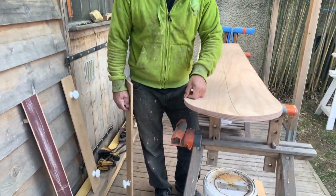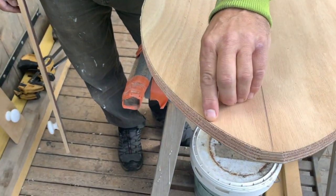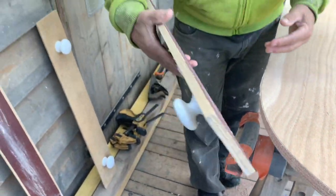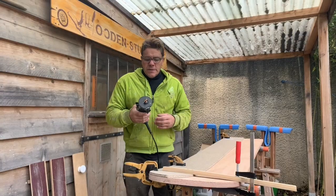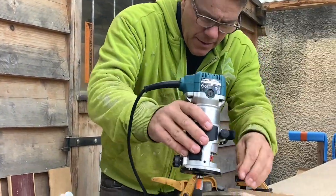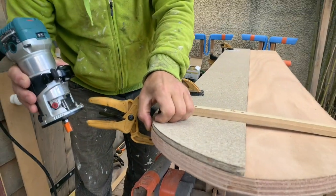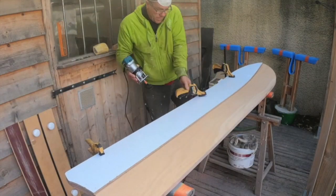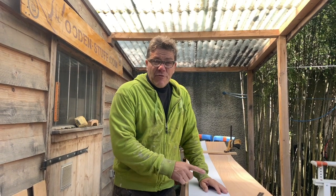Next we've got to make sure that the rails are 90 degrees to the line, and as you can see there's a little bit of spare. You can do that with a sanding block. The router is set up with a copy bit and principally what we're going to do is go around the edge and take off the small excess of material. Flip it over, rinse and repeat.